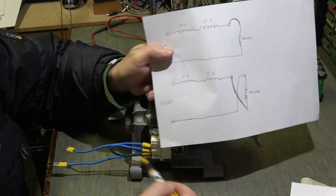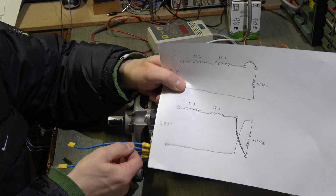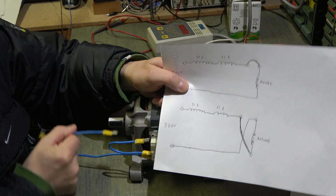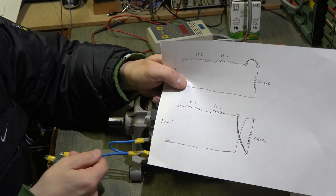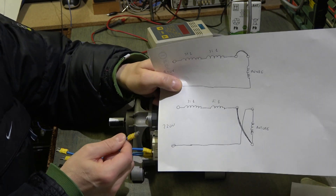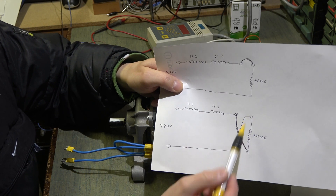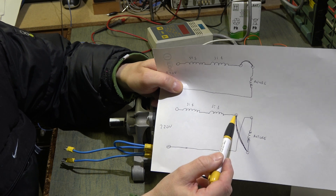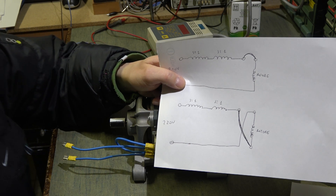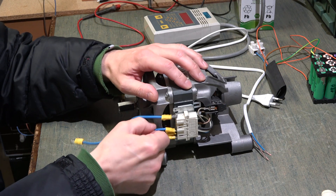It is connected with the central connector and it will turn in one sense. There are terminals 1, 2, 3, 4. To invert the sense of rotation, you unlock the central connector, take the wire that was going here, bring it underneath, attach the other one here — changing that connection. The phase I now brought from here and the other wire I brought from the other part. By doing so the engine turns in the other direction.